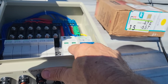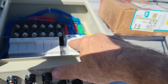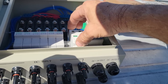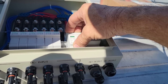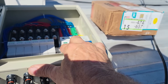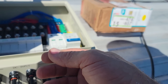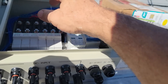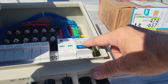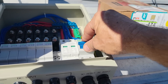Once set up, if the lightning arrester trips, it changes from green to red or orange so you'll know it's tripped. The thing is you can't reset it — if it blows, you'll be without power and probably have to order a replacement. I suggest ordering one to have on hand as a backup. You might even store it inside the box. This right here is a DC breaker — DC 250 volt, not an AC breaker — be sure to differentiate on that.